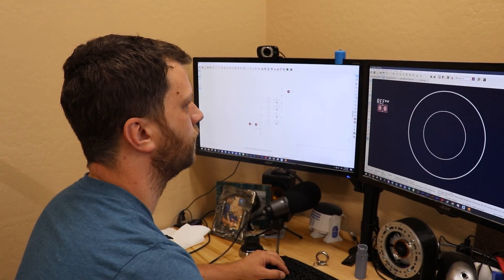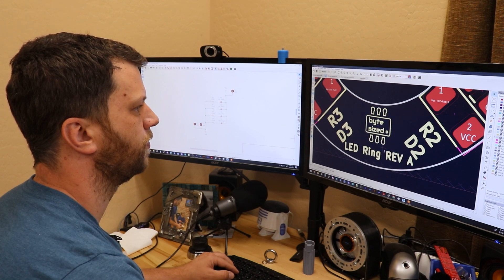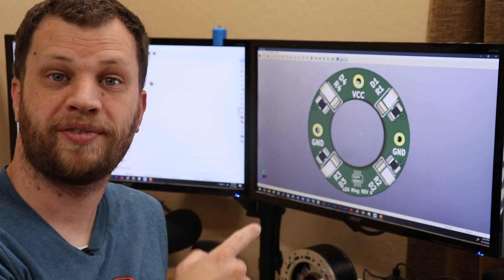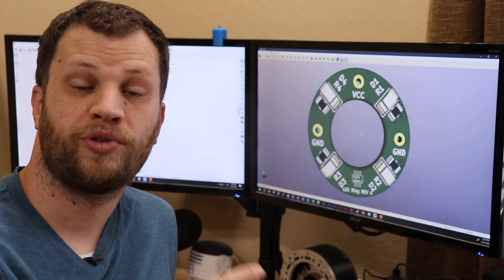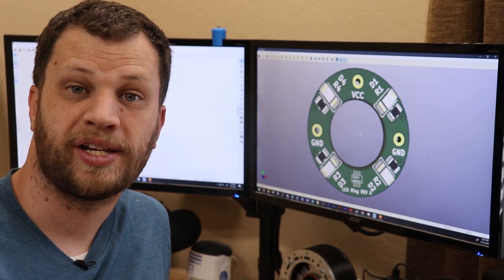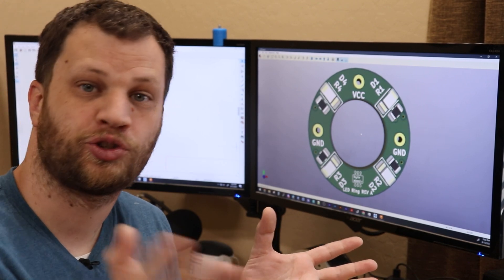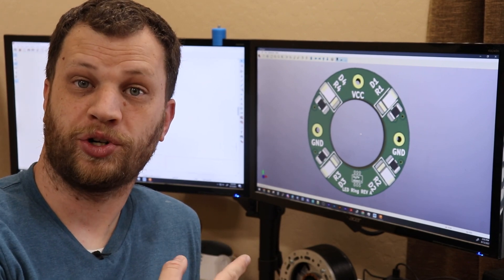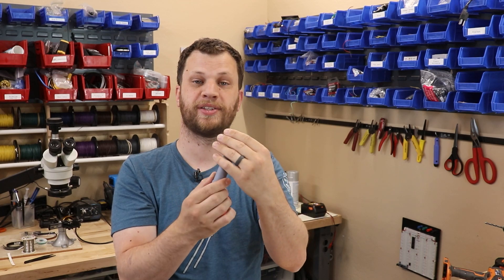So I need to go ahead and design that on the computer. Here's what I've come up with — it's a circular PCB that is 20 millimeters in diameter with an 11 millimeter hole for the Sharpie in the middle. I have four LEDs along with four resistors to limit the current going through the LEDs. The LEDs and resistors are spaced in a radial pattern around the outside of the board so that pattern will evenly distribute the light all the way around the Sharpie. I've ordered these PCBs from Digikey, who is also the sponsor of this video. The standard hilt piece is pretty much ready to go, so now I can focus on designing the accessory pieces that will make it unique.